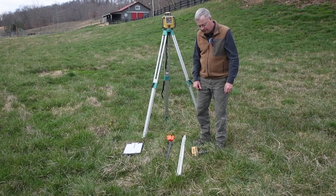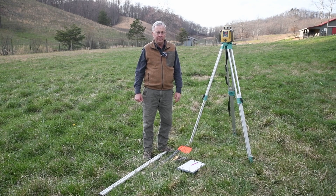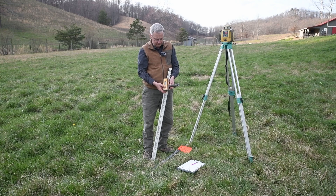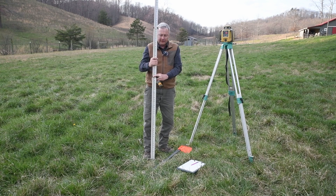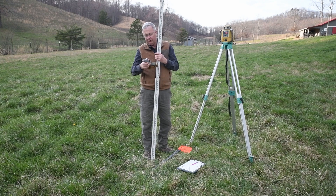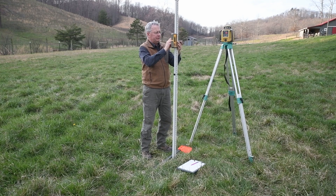The next step is to get the rod ready. This is the rod we're going to be using — they come in all different increments; this one is in inches. The laser is set up and rotating. Here's the grade rod and here's the receiver — I'm going to turn the receiver on. Now I'm going to extend the rod all the way; it's in sections. Each one will lock into position with a button, and it starts at zero feet and goes all the way up to 16 feet. We're going to use the front scale on the rod, and to do that you have to open up the clamp on the laser receiver and place it against the rod. Make sure that you aim it so that the laser will reach the receiver.